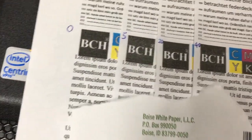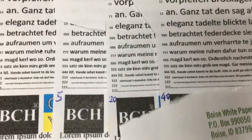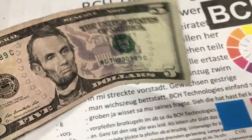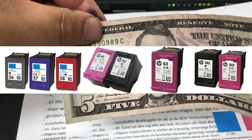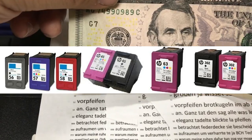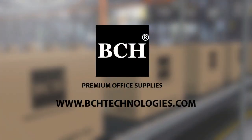We're looking at things at a very small scale — let me compare to a commercial printout on the product page. After 40 cleanings, the print is still very sharp. We think ultrasonic cleaning is safe for integrated cartridges — integrated cartridges are like HP and Canon, they look like a little black square with a printhead on them. I hope you enjoyed this video. Don't forget to subscribe, and visit us at www.bchtechnologies.com. Have a good day. Cheers.